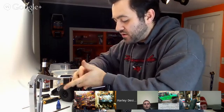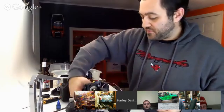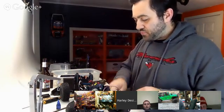And they were counterbored on the backside. There was a shoulder on them, just past where the big bearing mounted, and there was a thin spot between that and the inside of the output, so you would end up shearing those things off. That's where we would find it most commonly. I wonder if I have one around.